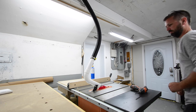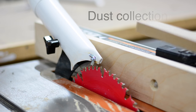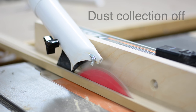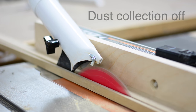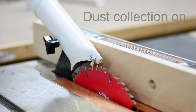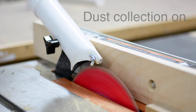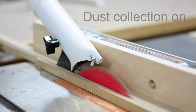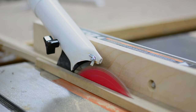A shop vac is really ideal for this type of dust collection because it has really high velocity, which helps get dust out of the saw blade rotation. With the dust collection off you can see all that dust flying out of the blade and coming right back at me, which is pretty typical with MDF. When I turn the dust collection on using one of these remote starts, you can see it collects a large portion of that dust — I couldn't be happier with this. If you like this project please give me a thumbs up, and if this is your first time here please hit that subscribe button. I'm Ryan Nodwell, thanks for watching.